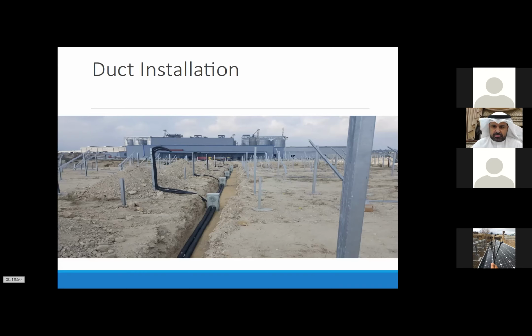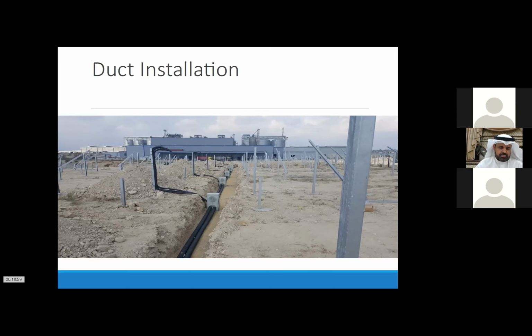Most possibly it's not the modules. Like I said, in the early days in Germany, like a lightning protection, they put the earth just down to the soil with an earth stick. There was no return towards the inverter or towards the transformer. In a normal house the transformer is far away, but normally the house gets an earth. So either the earth is connected up in the soil, and you should reverse at least to this earthing point, or go back towards the inverter. You should always earth the inverter coming from the AC board and the modules coming from the rooftop, because some leakage and stray currents can go up to the roof, and then when you touch them, you have these phenomena of touch voltage. Of course, it can also be faulty wiring on the DC side.